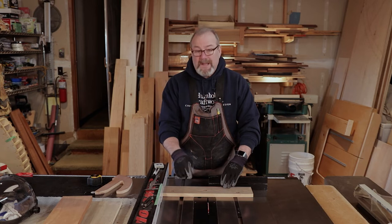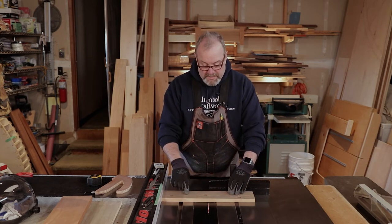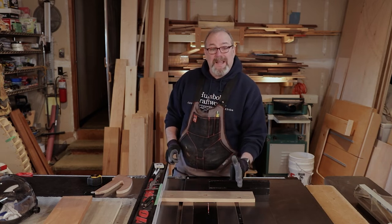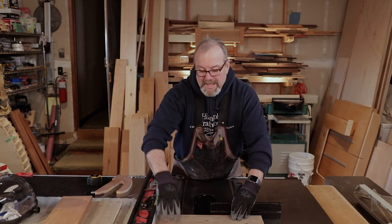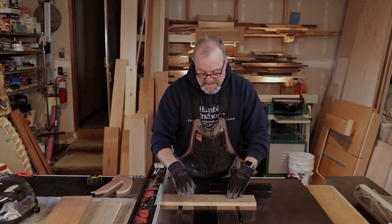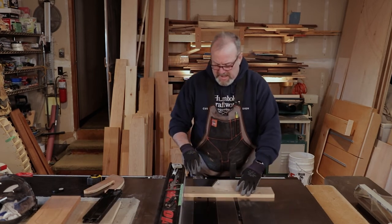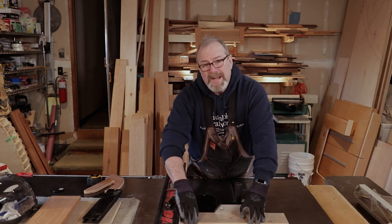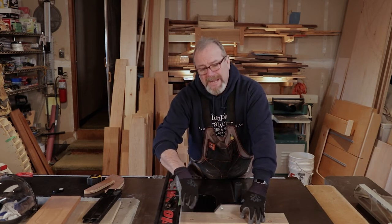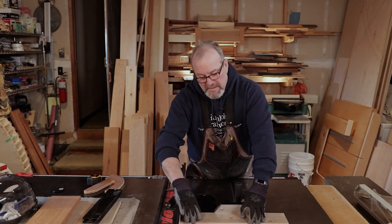But if you're going to make a 5-inch cut or a 6-inch cut or whatever, and this is a piece that you want, do not cut it with this on this side. If you're cutting like this, it doesn't matter if you're pushing this up against here or not. This is the improper way to cut. I'll just do it like this, set my saw to 5 inches and make a cut, and then take this as your cut. Because what can happen, and it still can happen, is you've trapped that wood in between there, and all it has to do is turn slightly and it's going to come back and hit you.